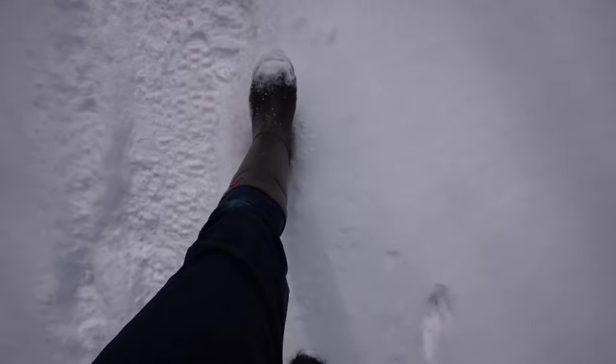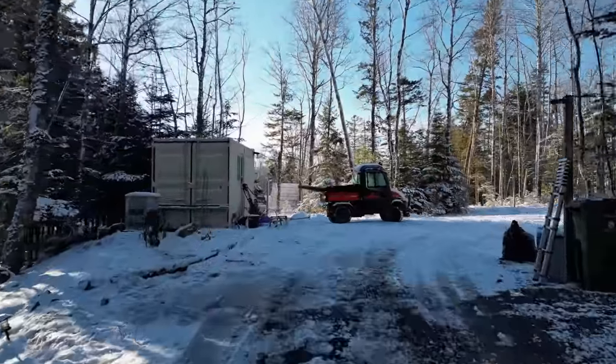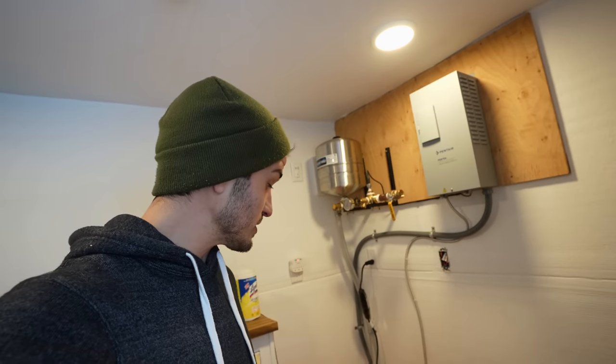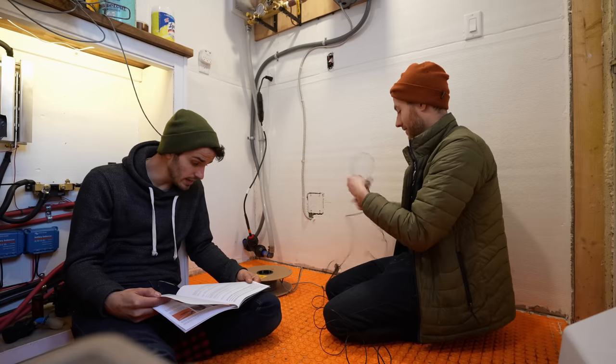The very first thing we're going to do is reinstall our in-floor heat that we did last week. That is a huge shout-out to all of you in the comments who pointed out that we did it completely wrong and would have either burned the building down or just malfunctioned the heat. We did it every row so they fit in those little grooves, but it needs to be every third and every second. So we're going to redo it now and then get started on laying the floor — let's quickly do this because we should be experts by now. Second time's the charm.